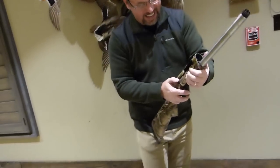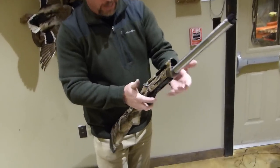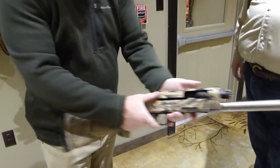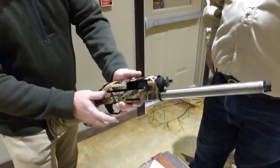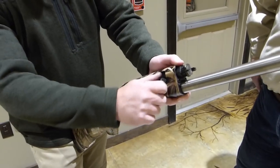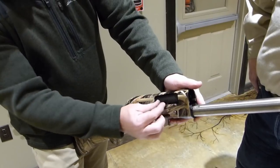I think to say. One thing we'll do next is really just remove the bolt. So you want to hit the release, let the bolt come forward, just slides all the way forward to its frontmost position. And you need it in this position to remove the handle. You've got to remove the handle to get the bolt out. So again, it just comes all the way forward.